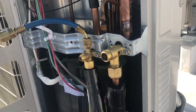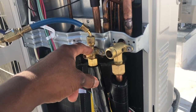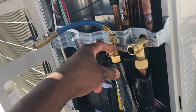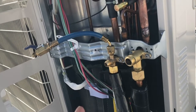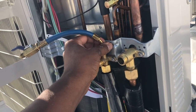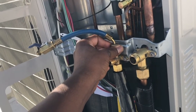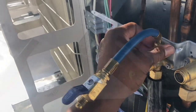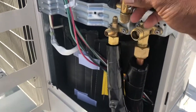Now what I'm going to do is remove the Schrader from here when pulling the vacuum. With the NAVVAC it'll pull down in no time. I don't like pulling a vacuum with the Schrader still in — it's so much faster to remove it first. On this particular three-ton unit I have enough room to hook up my Schrader removal tool, which isn't always the case due to space limitations. I've got enough room here — let's check it out.